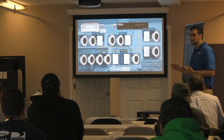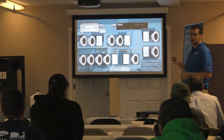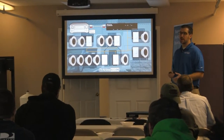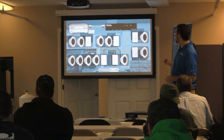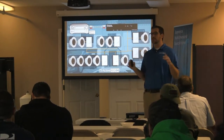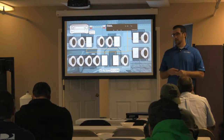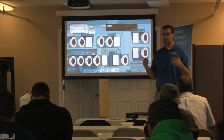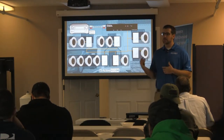Each of these attenuators can be up to 100 watts. You don't need that with this particular setup — you could use it as 10 watts or 35 watts. Each one of these could be tapped at 2 or 4 watts and you would have plenty of sound for that one room. I know that sounds low, and we're all used to dealing with 60, 75, 80, 100, 150 watt RMS speakers.